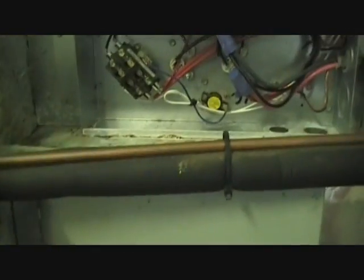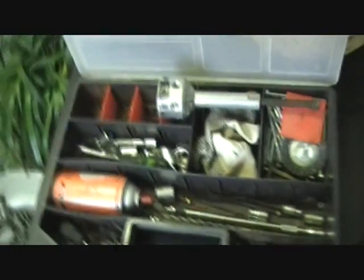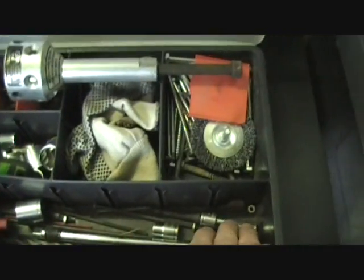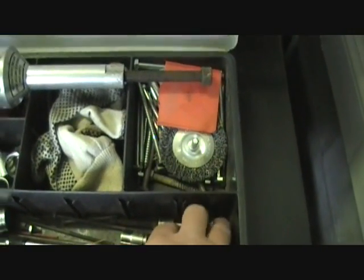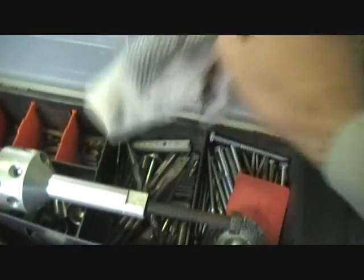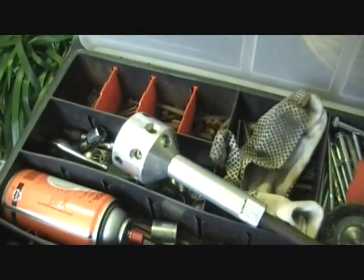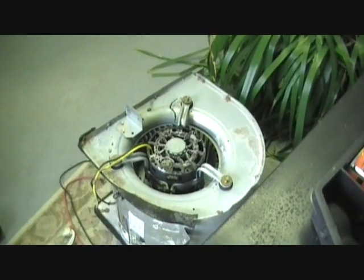So we're going to take it apart and change this one too. I guess I'll just make my living for now on changing Trane blower motors. This is my blower motor removal tray - it has the aero coil right here, all the common sockets for the motor brackets, the puller, a couple deburring wheels, and my glove. Everything I need to take a blower motor off should be in this tray. I'm about to take this bad boy off and run get a new one, because I used my replacement a couple days ago.